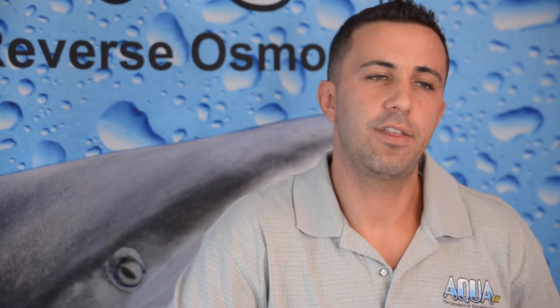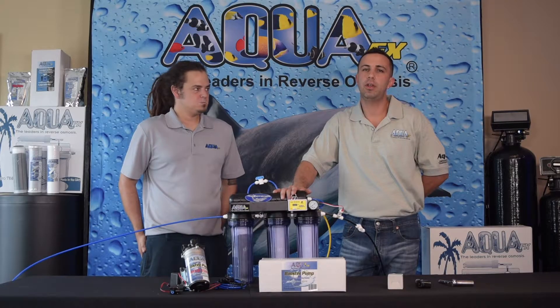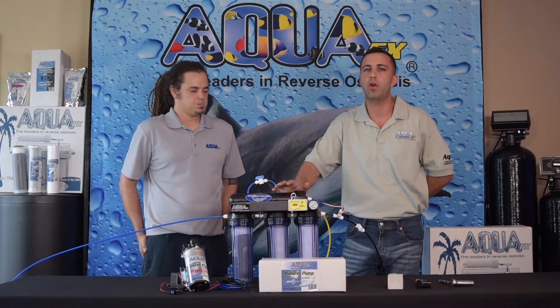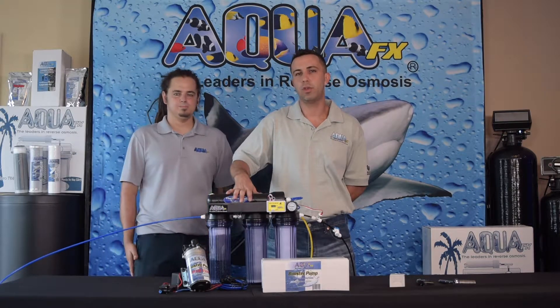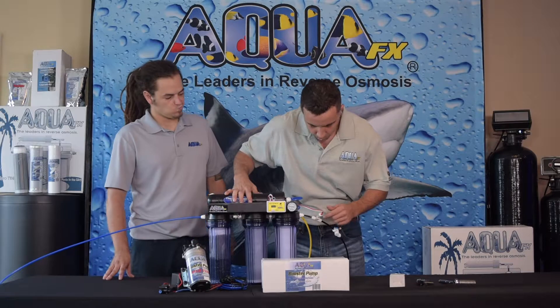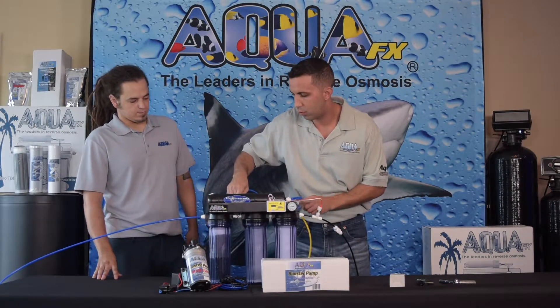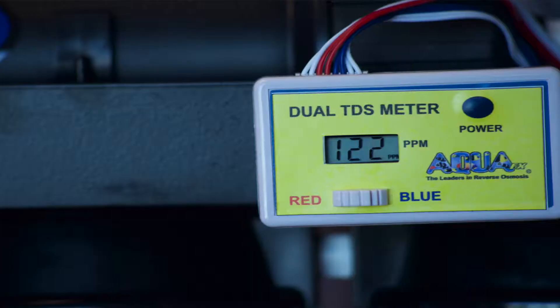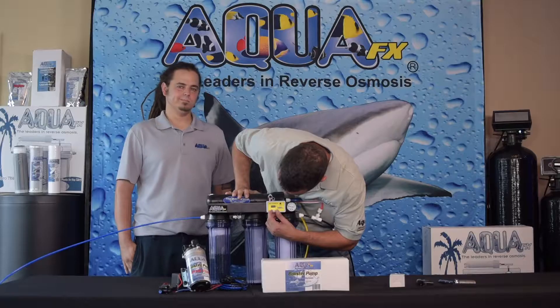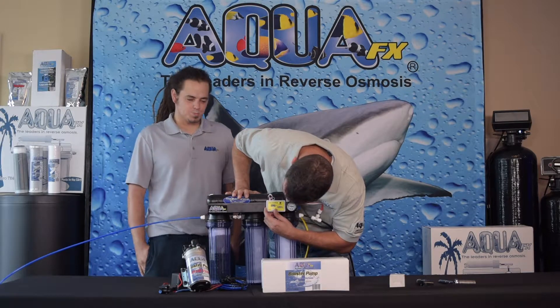Initially we're going to go ahead and measure the TDS out of the RO membrane. Higher pressure should yield higher rejection ratios as well as slightly more production, so we're going to go ahead and measure all that. We've just turned on our Barracuda Glacial system and we're going to check our initial pressure and TDS values and see if they correspond with our 90% minimum rejection that we're looking for from our RO membrane. I've got one TDS probe hooked up before the system and one after the RO membrane but before the DI filter. Turning on my TDS probe I can see I've got about 121 or 122 parts per million incoming, and switching to the out I see I'm at 16 parts per million, which is acceptable and actually pretty good — it's more than 90%. However when we introduce more line feed pressure we're going to get a lower value, which will translate into longer lasting DI resin.